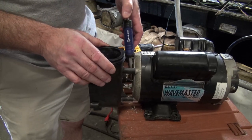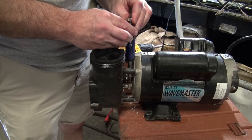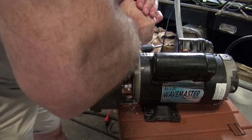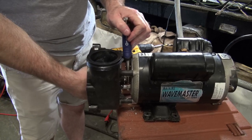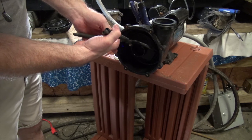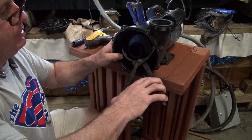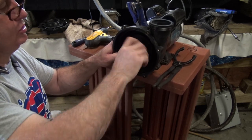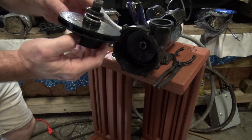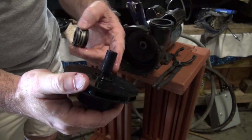This thing's got a pretty good size gap behind the impeller, so I should be able to use larger vice grips. I'm going to get those in there and crimp them and see if I can turn this impeller off with my hand. I don't think I'm going to be able to, so my oil filter pliers — just open them up to the widest setting. It's one of those things where if you can get it to break loose that first little bit of a turn — which it just did — you can turn it right off. You can see this is still in good shape, so I'm going to be able to pull that off, stick a new one on, reuse the impeller, and clean the shaft up.